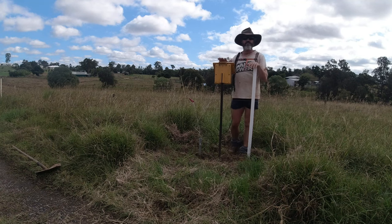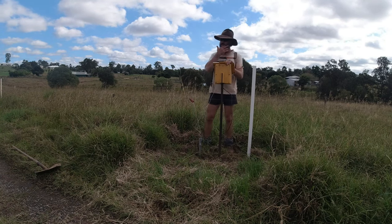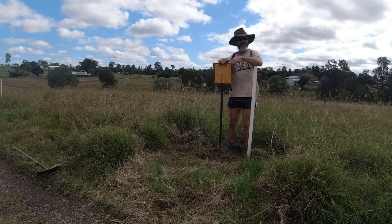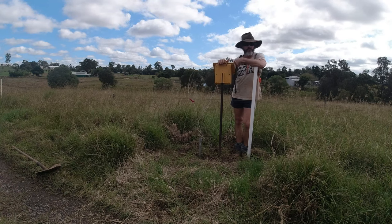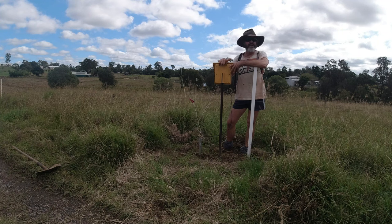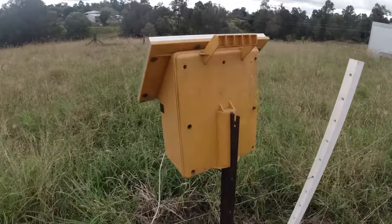This is where I've got my electric fence charger for my single hotwire setup. I've got a galvanized star picket there that's six foot long, driven five foot into the ground. This is another six footer but it's only driven two foot in the ground. The issue is when we turn this charger on and we're getting water through the cell grazing, this makes a weird noise. It really sounds like it's arcing out inside and shorting.